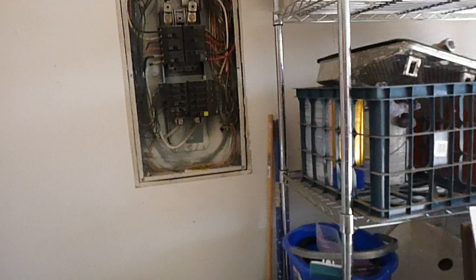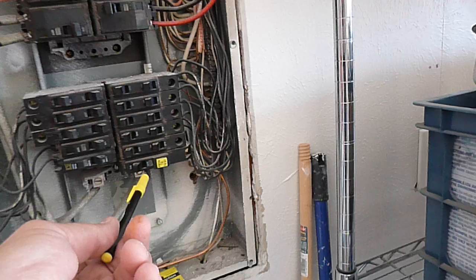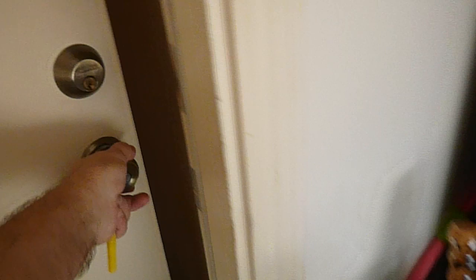This is the door opener button — it should not be closer to the floor than five feet so small children can't reach it. There should be a safety notice posted next to this door switch, and this door should have a self-closing spring on it. The attic ladder rails do not extend properly. Up in the attic there's a lot of storage — plywood roof decking over lath. Back to the lawn sprinkler system: they've got a cord running all over in here.